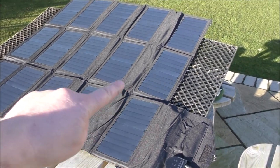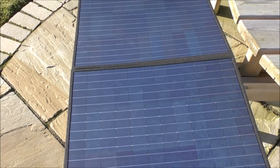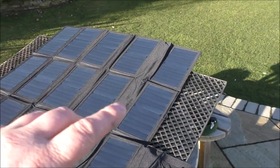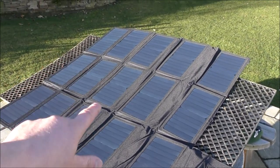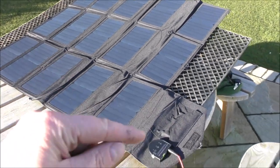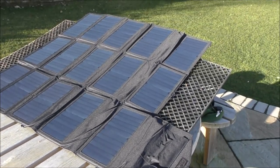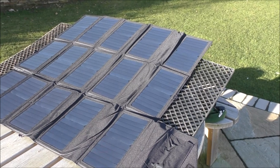The multifolding panel basically folds up to the size of one panel just inside its pouch part, but it's producing half what the bigger proper panel is producing. That's understandable: between every one of the individual panels is a connection and cable, and every connection and cable means resistance. So although it will produce power, all that resistance from the multiple connections means the actual output is approximately half. If you want maximum sunshine-to-power conversion, go for the big panel. If you want the luxury of carrying it in a backpack, go for the multifolding one — but it will produce a lot less power.